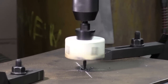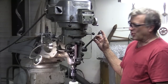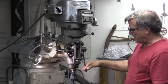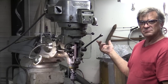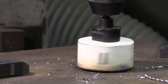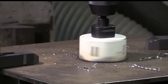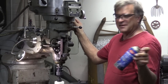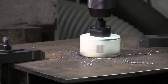You can look underneath and see the chips. Oh yeah — glasses! Another good feature with the Bridgeport: you can see the handle for pulling it down is all the way up here. Now I'm all the way down against the metal. This will release and come up so you can reset it and keep moving it back and forth wherever you need to be, rather than reaching all the way around. You might want to turn your sound down a little bit. A little shot of cutting oil on it — that'll keep it happy for a few minutes.